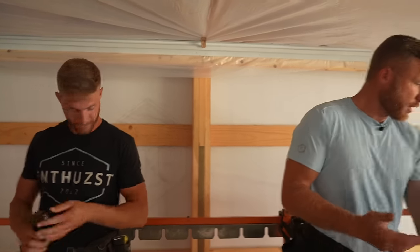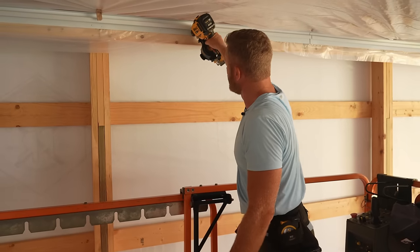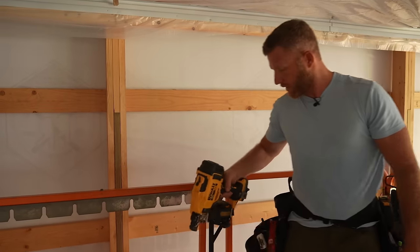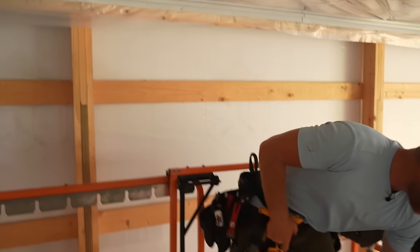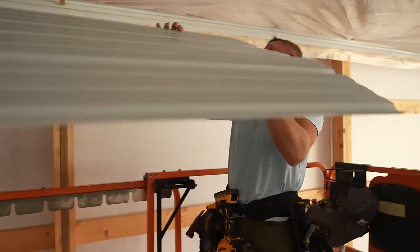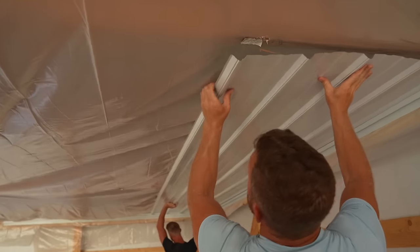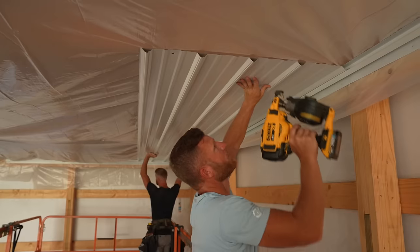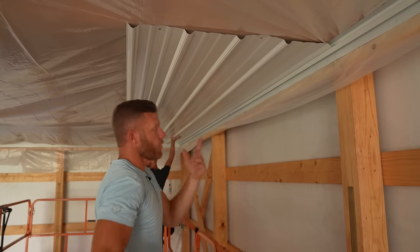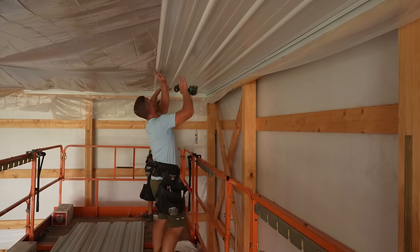What we've got is the coil gun — it's like a roofing gun, we always use it for trims, puts a nice fat shingle nail in, and it's great for doing steel ceilings. I have to fasten this first one but it's going to get overlapped, so we don't want a screw there. Greg already snapped a line on the truss. See that line? That's what I'm going to line up my steel to, then take my shingle nail — boom — put that in. The next sheet's going to overlap this so you won't even see it.